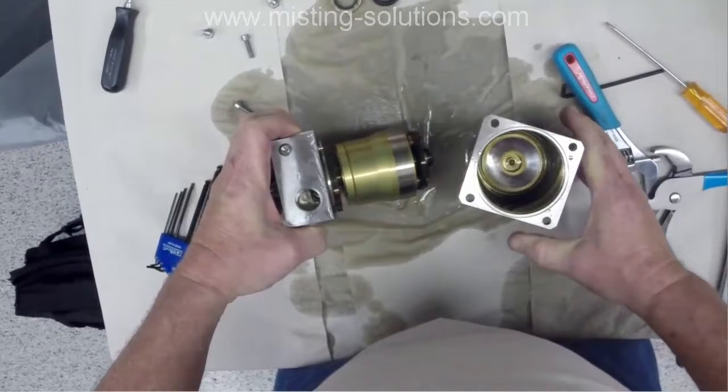All right, let's stop the video here for a second. So you've got a few different components in here, and it's not really that complicated. Here are the pistons and their shoes, and the pistons move back and forth within this housing here. And this plate right here, I call it a wobbler plate, and it's in there tipped at an angle. So as the shaft rotates this particular device here, these shoes of the pistons go up and down against this plate. You'll understand that once you get it apart and look at it a little bit. But basically this plate being at an angle pushes these pistons up and down, back and forth.